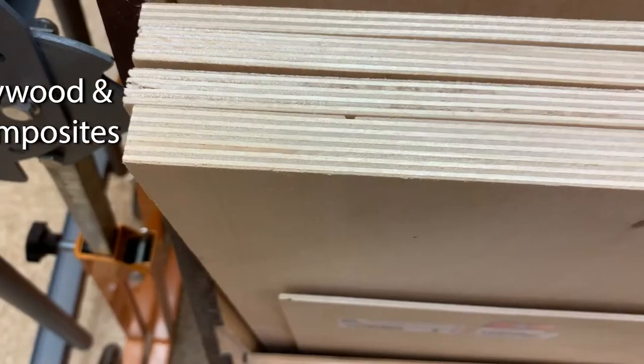Don't sweat all this and definitely don't let it deter you from going to a lumber yard — that's where the great prices and great selection are. Don't hesitate to ask questions; if you don't understand board feet, ask them to explain how they're measuring and calculating. Every time you go, you're a little more experienced than the last time. Materials like plywood, MDF, and fiberboard can be thin layers of wood glued together or composite material that may or may not have actual wood in it. These are great for projects like cabinets where you need wide surfaces, since they come in 4x8 sheets. They also have little to no seasonal movement — MDF and fiberboard have virtually none, and plywood just a little bit.